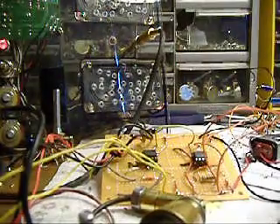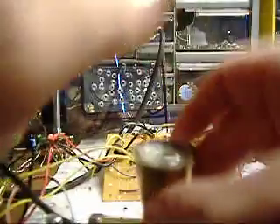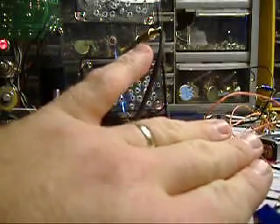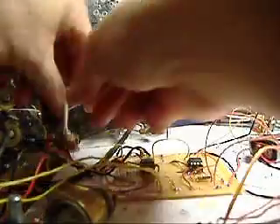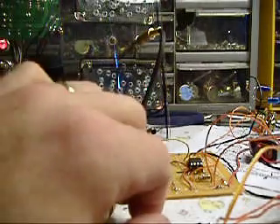This control device is optical or knob, and you turn this on. It's just a square wave generator basically, with an astable and a monostable side of the circuit. Put your hand over here — kind of changes the pitch. I've also got these rotary switches here; they kind of change the tone a little bit, but not much.